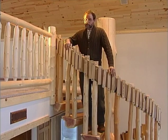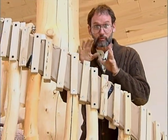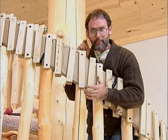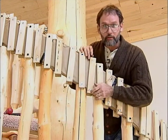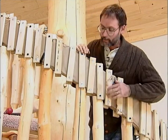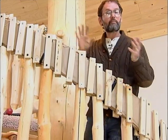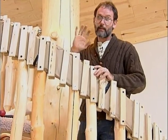As you can see, it takes a lot of clamps — we've got one every three inches. If you don't have lots of clamps you'll get bulges, and you don't want any of that, so lots of clamps keeps everything nice and tight. We're using paper rather than plastic because it breathes — the glue needs to dry through it — while still catching all the glue drips. We're going to give it seven days to dry; if we take the clamps off too soon the whole rail comes apart, so we don't want that.